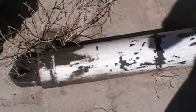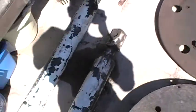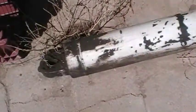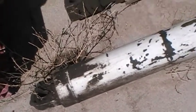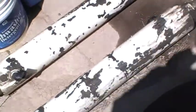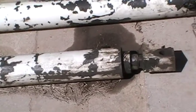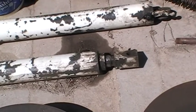Right here I have two larger hydraulic cylinders that I pulled off of a street sweeper I bought at a government auction. I scrapped it out — it was no good. Those cylinders right there are two-way cylinders, which means they push and they pull. A lot of common hydraulic cylinders, like on car jacks, are basically one-way cylinders — you pump them up and then gravity pulls them back down.